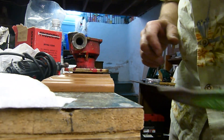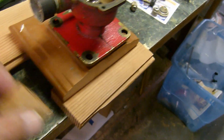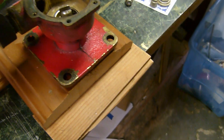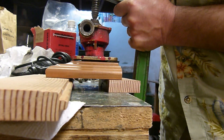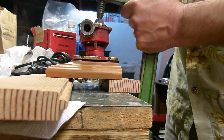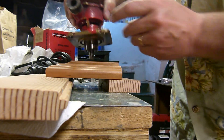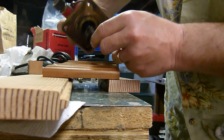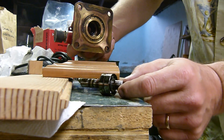I might have to stack this up a little bit, so I'm going to reposition my jig. I've now got it spaced up with a couple of blocks so it doesn't fall, and you can see the shaft is now down inside. I'm just going to turn this block over like this, set that right in position, and set the clamp back on it. That felt like it dropped out — take the clamp off, lift the pump up. It's not quite out yet, a little bit more to go. I can do that with my finger. Here's the bearings — they just came out, and there's two seals up in there. There's the bearings, I just pressed them out.